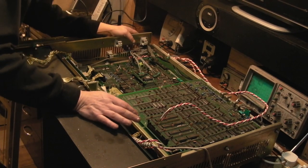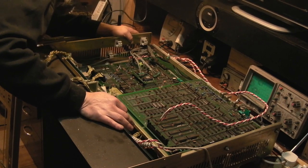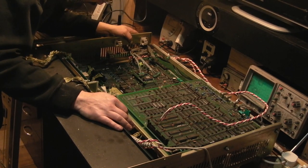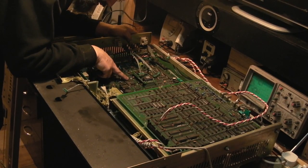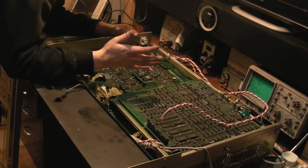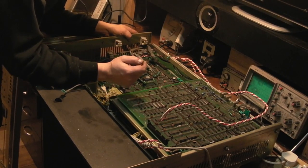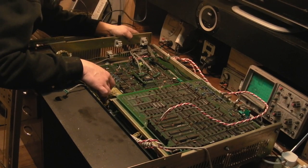Now, there's an NEC chip here. That's a D8279. Don't think that's it. This is 7400 series logic here. Same here. You know what, I cannot see an actual CPU on this board, even though the board does say CPU IO. Most odd. Let's get the keyboard disconnected.